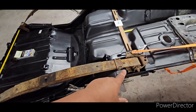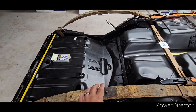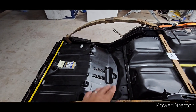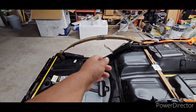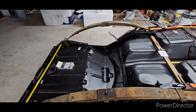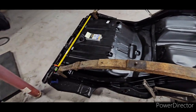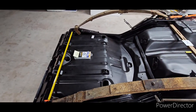Another great thing about using the leaf springs is this stud here and that stud — that's where your leaf springs will get mounted to a plate, and that plate goes under your axle. And if your axle is not straight, your car is going to be doing what they call dog walking — it's not going to be driving straight. From stud to stud, that axle is on the money. I mean, excellent. It's reminding me of when I did my 68 Firebird — the white car — and everything fit like this, and when it was time to put everything back I did not have to fight anything, because it just works. You can see that the spring shackle is going to go right there with no problem.